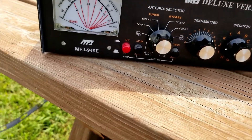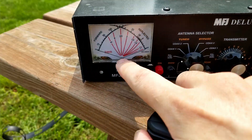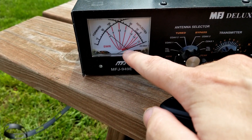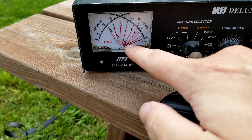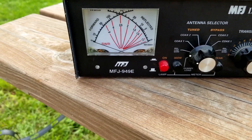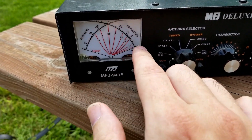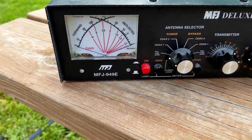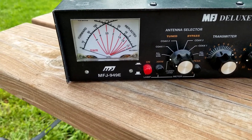What I was doing was moving the knobs on the front of the tuner and watching the SWR meter — you saw it go up and down, and you heard the big click which was me tapping the primary inductor inside the tuner to find the best match. Looking at the front of the tuner itself, there are two needles: one going off to the left and one going off to the right. What you're trying to find is where they cross, which puts you at about 1 to 1 — which is what we saw on the front of the radio.